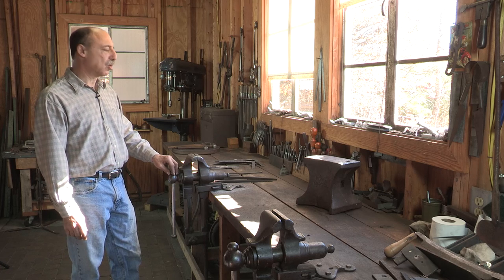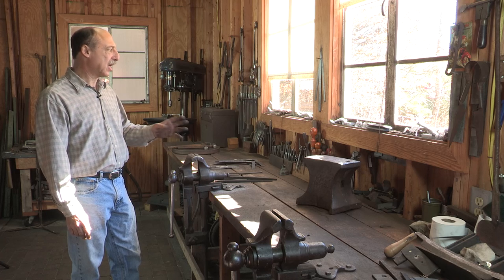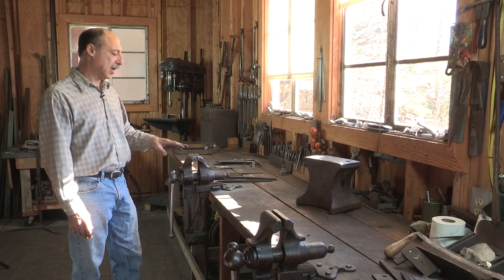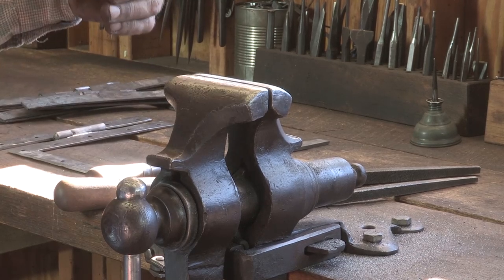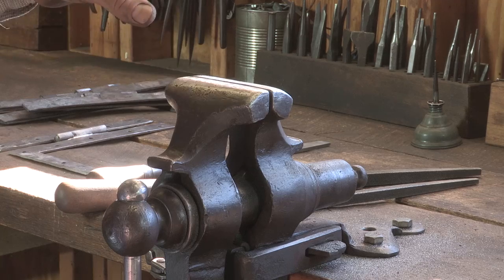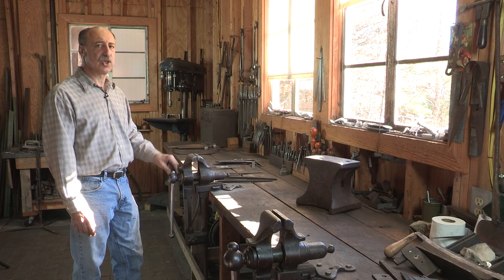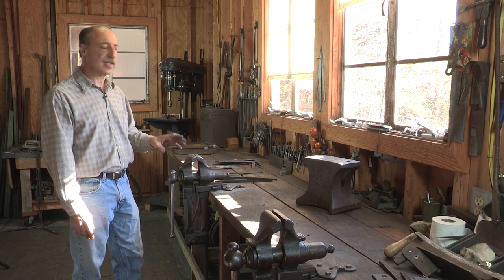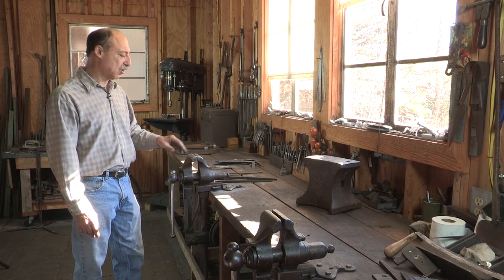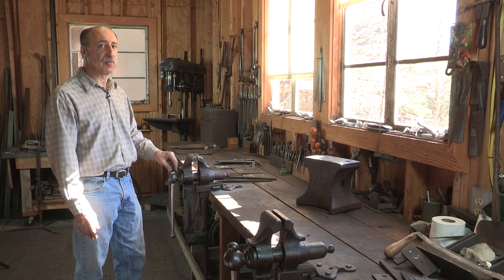The positioning of the bench is really important. You can see I've set up the bench and the vice with lots of window light coming across them, and that's really helpful in filing and assembly. This light coming in through the windows is much more effective than overhead light at highlighting the shape of the surface you're working on. The light from the window shows shadows due to ripples in the surface, which really helps you see when things are flat enough, smooth enough, or uniform enough — irregularities become highlighted by this horizontal light much more so than by overhead light.